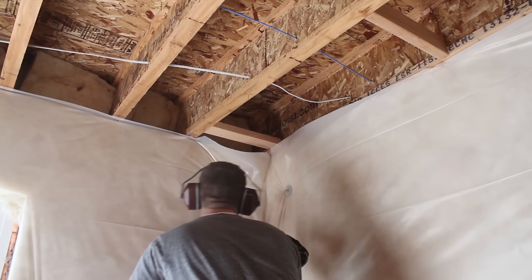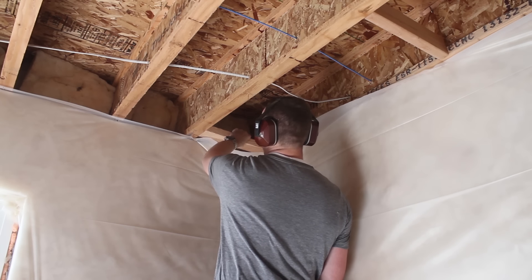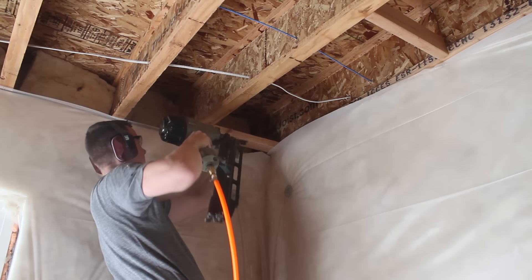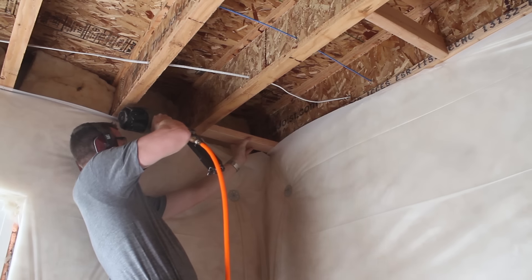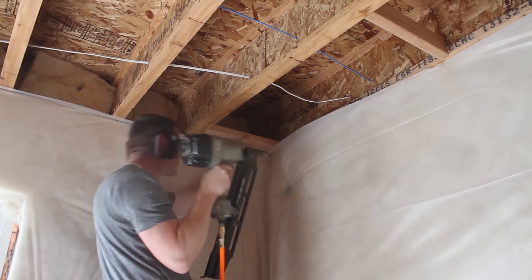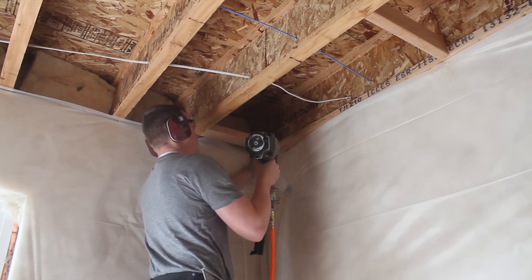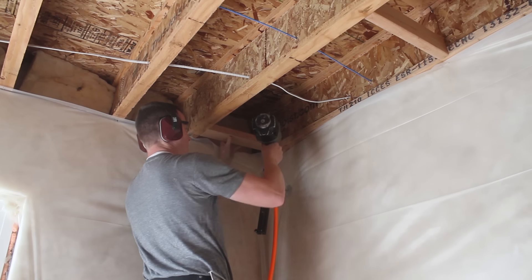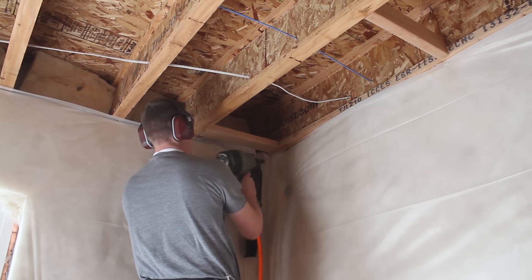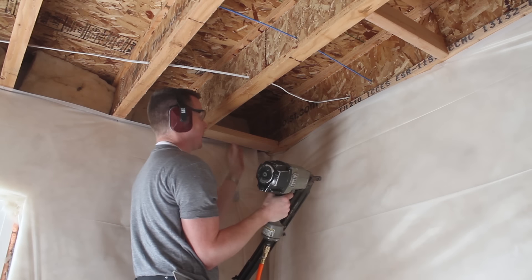To tack these up here, I've got this one which is pretty snug, which is great. I'm going to put it pretty close to where the end of my wall is, and then with the nail gun I'm just going to drive it in. On this side I can't come through from this side, so I'm just going to toenail it in. I'm going to push this plastic back so I can see what I'm doing, and then toenail that in. It's kind of harder to do from this side, so I'm going to have to do one from the bottom, and then use my hammer to hit that flush with the board.